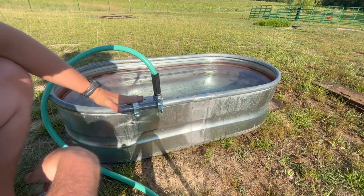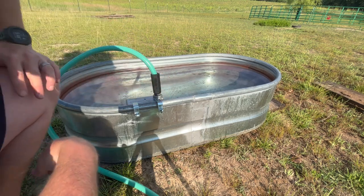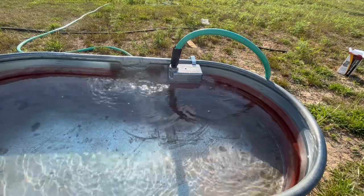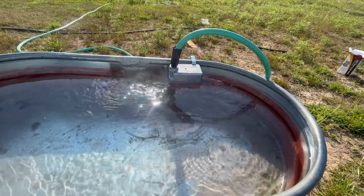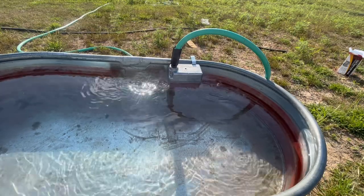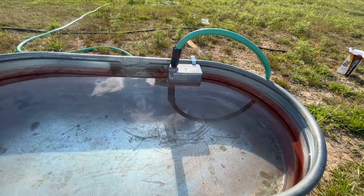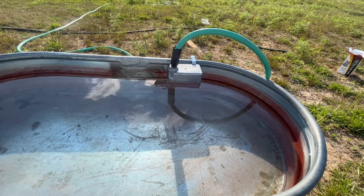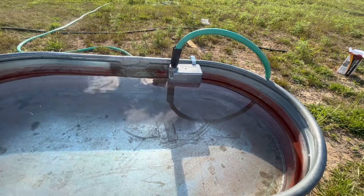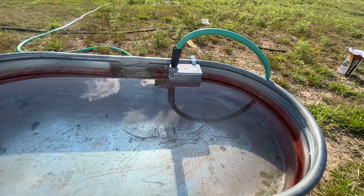That's it — we're installed, it's put together, it's attached, our hose is on there and you did it the right way. We've installed it on the high end. Let's turn it on and see what it does. If I've done this right, we've turned the water on, the tank is filling, and within a few seconds it should start to pressurize and automatically shut itself off. There it is — done. Water's running, and as your animals drink out of this and the water level goes down, it'll automatically kick back on and slowly fill it up. No more having to keep in check with your water levels. Hope you liked this video — see you next time.